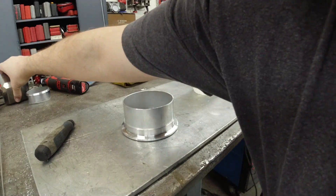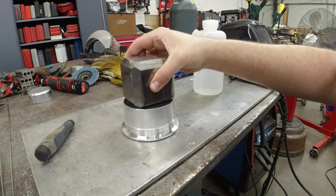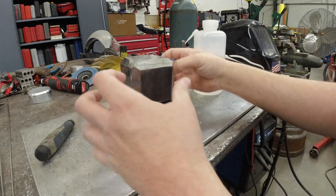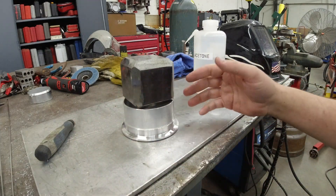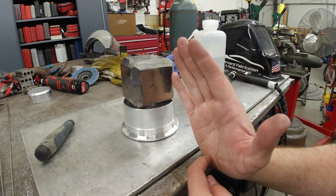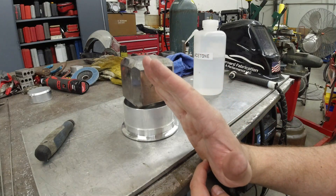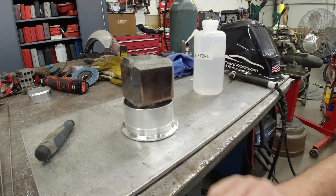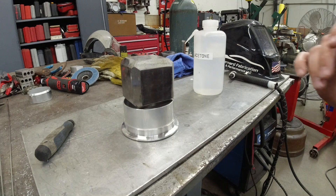Put a little weight on it to help hold it so it doesn't try to pop out when it starts welding. Aluminum's not that bad at distorting, you know. Like when you weld steel, if you're welding down here, it'll pull, and once it dries it'll kind of go back a little bit but it'll still be crooked. Aluminum doesn't do that as bad — well, I don't notice it anyway.